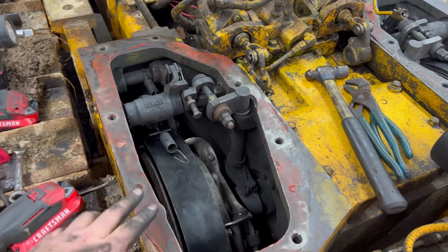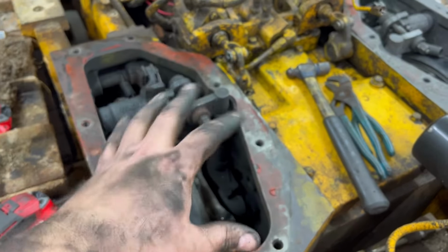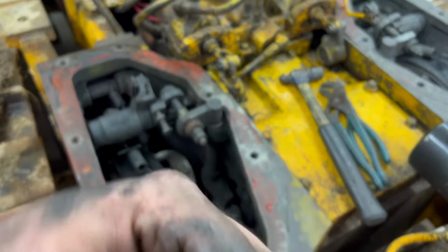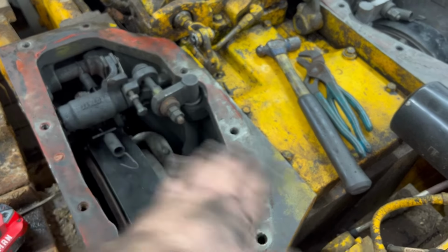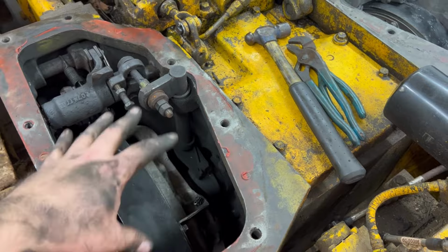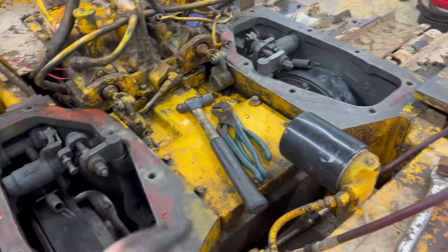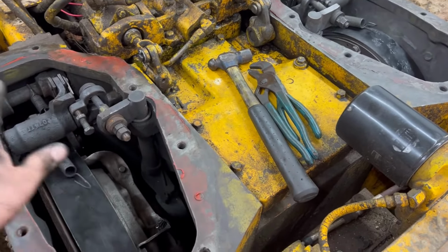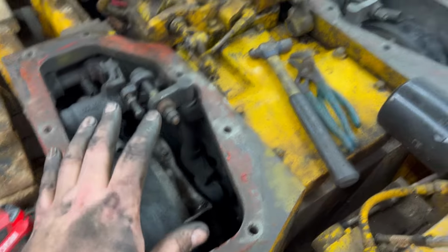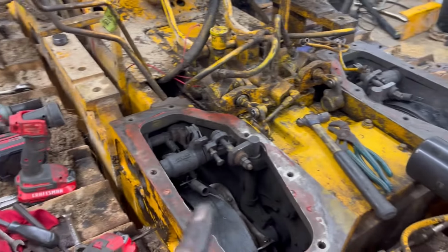At this point, I'm going to put the covers back on. You can see how we had them siliconed. The whole reason we had to replace the clutches is because this thing kept getting water in it and the original clutches seized up. So we tried to seal everything up we could. And in the last pushing 2 years, you can tell there was not a drop of water inside these. So we did pretty good at that. So that's how I'm going to put her back together.